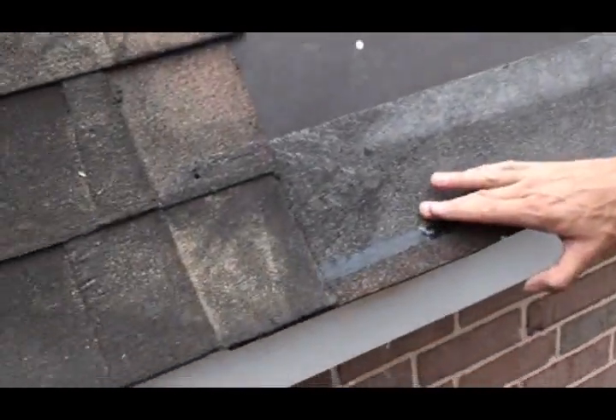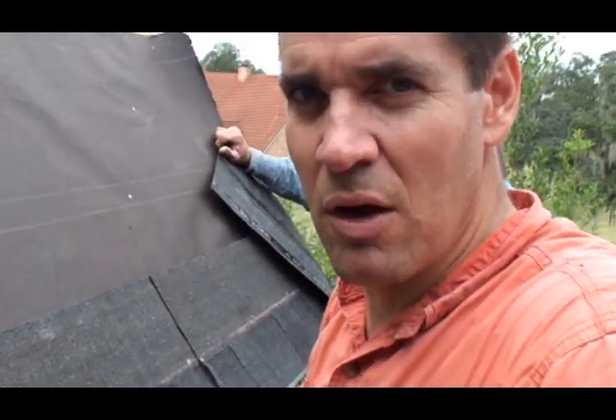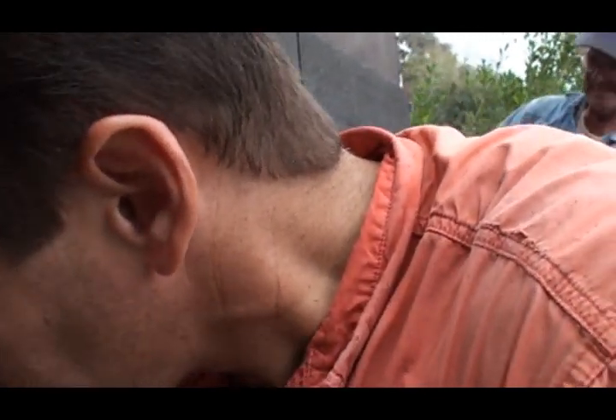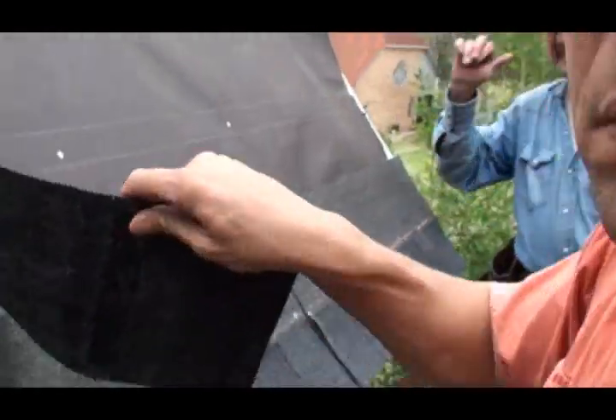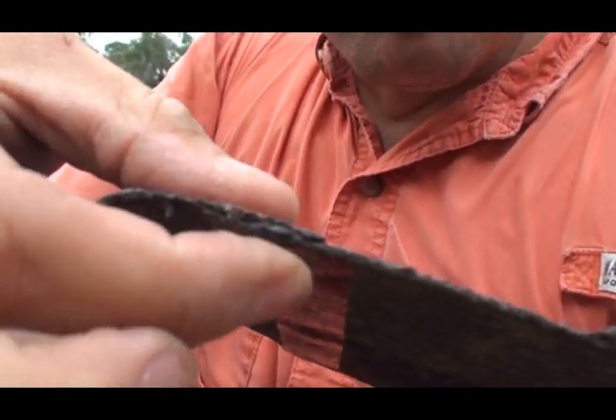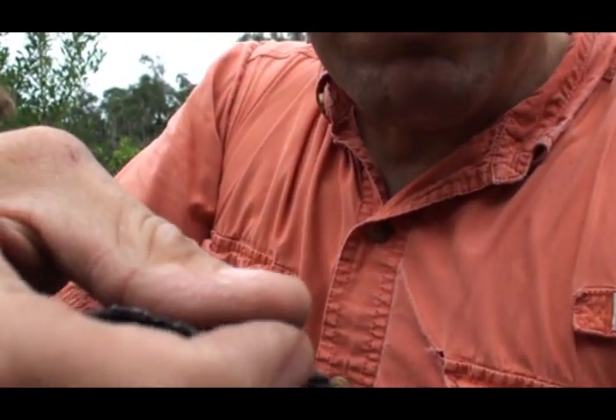The most crucial of all: the head of your nail has got to be flush with the surface of the shingle. If it's not, it will not pass code — the whole roof would have to come back off again for over-driven nails. The magical question is where do I put the nails in the shingles? Your nails go in your red line — some brands have white lines — but the shank of your nail must go through the double laminate. A double laminate is these two little layers right here.